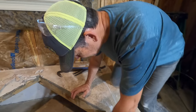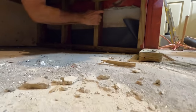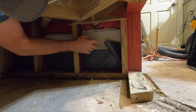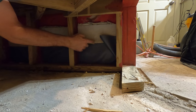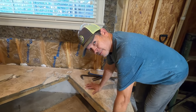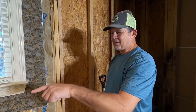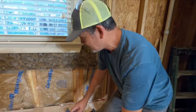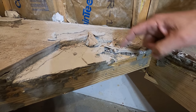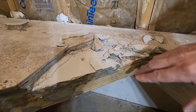You can see one of the repairs from the back side here Jordan. See right here — this is a repair. They cut out the original shower, put in new backer board and a new liner. Come on over here — you can see we've got three quarter inch plywood, you can see the trowel marks, quarter inch Hardy board, screwed down. So that's all correct.